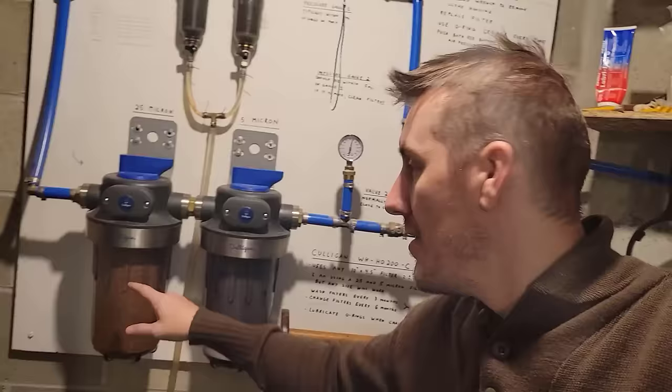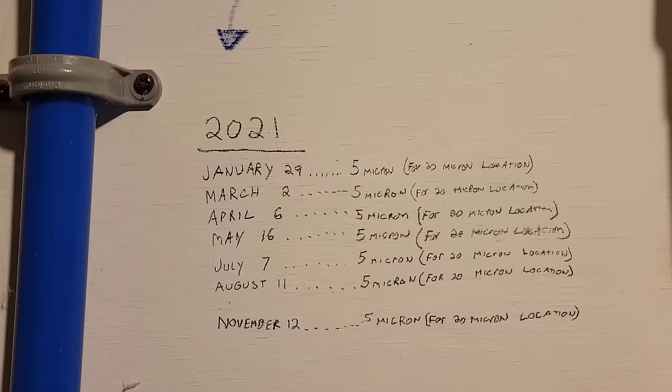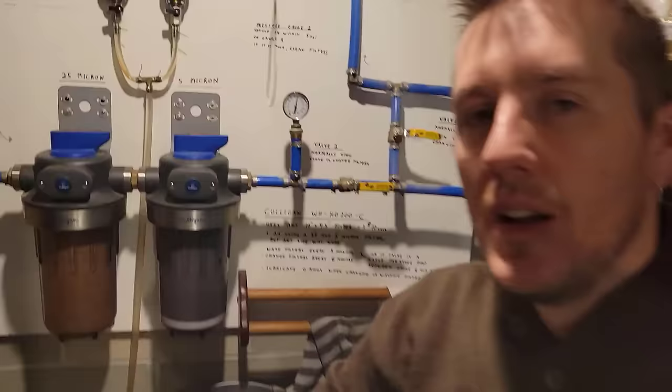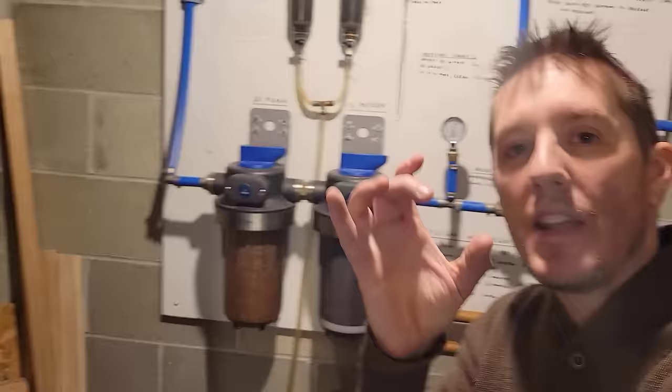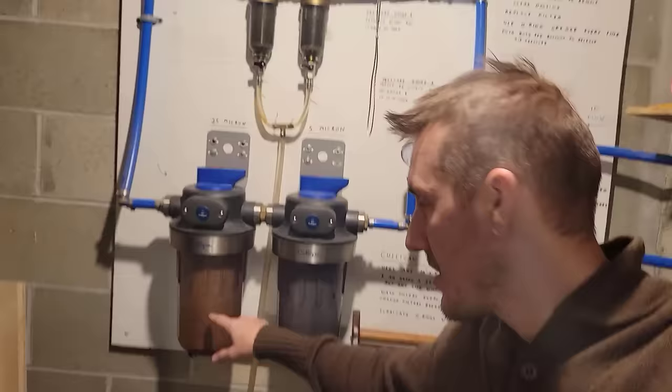This one I've been changing every month; this one lasts maybe two to three months. Every month I've been writing it down, so you can see — not religiously, but it's tracked. The filter looks a lot worse on the outside, but once you change it the inner core is still pretty white, so it still has some life left. These are really heavy duty and they've held up great. You can see when they need to be changed — I just come in, look at it, and say 'time to change that filter,' and I check the date — it's been a month, month and a half, two months.